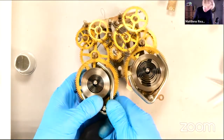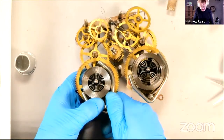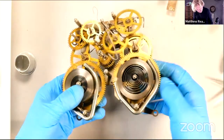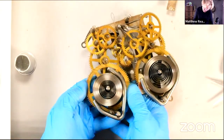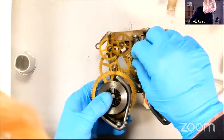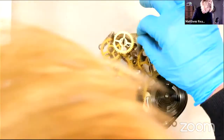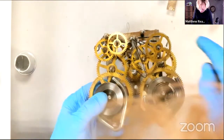It hasn't gone that far down onto the pillar, but I don't want to push it because I'd rather it didn't sort of explode. I think it's just pulling it across to one side. Yeah, it is. Right. That little motion work wheel can stay in place, please. Good. And as I say, just a fly to sneak in there. Might have been able to actually sneak that warning wheel in as well by springing the frame.